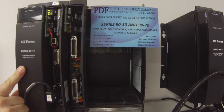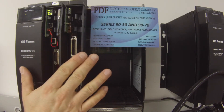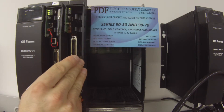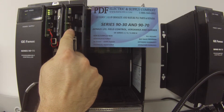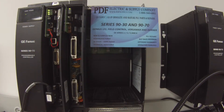In Proficy Machine Edition, in slot number two, I've added an IC697 PCM711. In this particular case I don't have a battery on this one — this is just a test that the module is working. Although if you do have a battery on yours and you're trying to keep a program or any information in there, please make sure that you keep your battery connected to this battery slot right here. I've configured port one using RS232 interface and port two using RS232 interface.